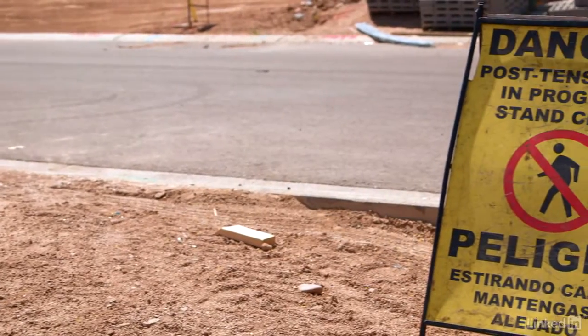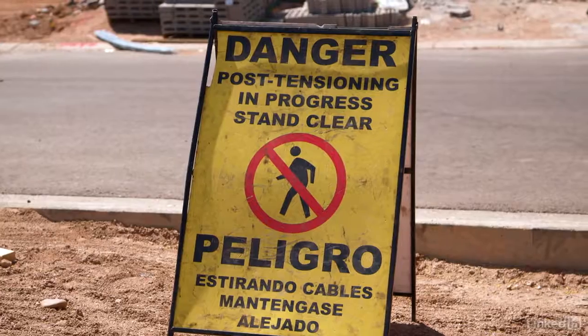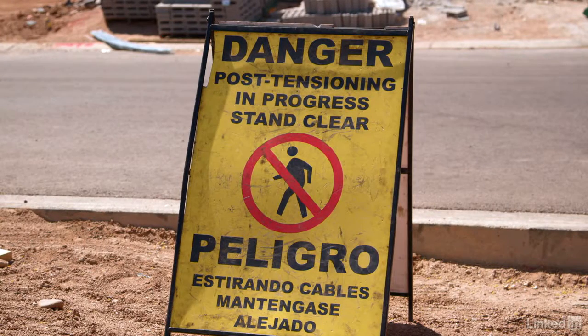You wouldn't stand under those cars. Don't stand behind that hydraulic stressing jack. If something were to slip or break, that 60-pound steel jack would be propelled backwards with about as much as 33,000 pounds of force. You can't move fast enough to get out of the way. And if it hits you, you're going to lose every time. Believe me, I've investigated 2 fatalities involving this operation. There's no room for mistakes, and everyone involved in this operation needs specialized training before they go to work.